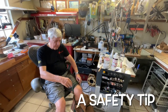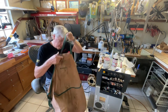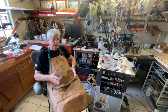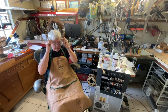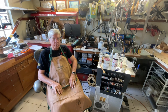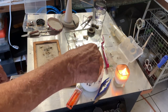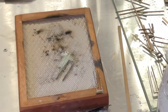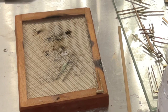Just a quick reminder that when we are mixing chemicals of any sort, we really should put our apron on - make sure anything that spills, spills on us. And of course, just as an added precaution in case anything spills on our face, just remember to put safety glasses on. Now you dip the piece in the solution and then light it and burn off the denatured alcohol. And what you get is a residue of borax that's really covering the entire piece.